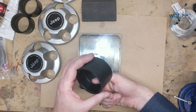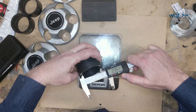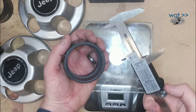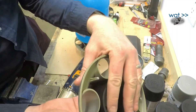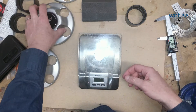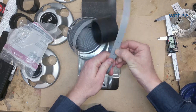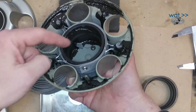With that teaser, let's look at our supplies today. This here is an ABS pipe coupler. This one I believe is a two-inch to two-inch - let's double check that: 2.370 inches interior diameter. Right, so schedule 40 PVC. The inside diameter of this coupling would probably correspond to that little lip in there roughly, and it happens to be just about the right diameter to do this. Another reason I chose this particular piece is I didn't have to cut it down at all - dropped in there, it happens to sit just a hair below the level of this, but notice that it's slightly loose.